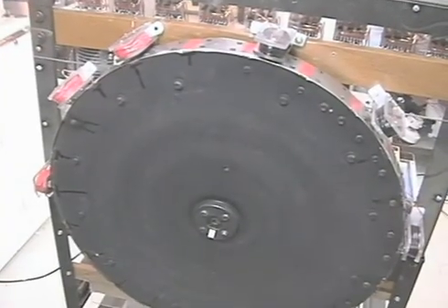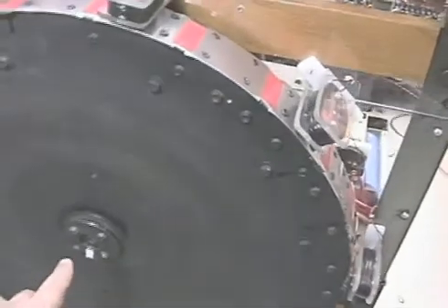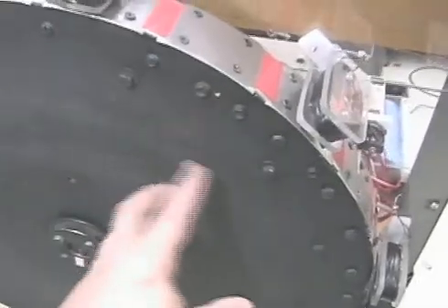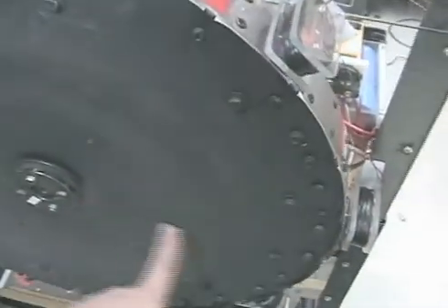The wheel is 25 inches, which gives you a mechanical advantage from the smaller wheel. A smaller wheel wouldn't have this mechanical advantage you get from the wheel being this large. It's basically like using a longer wrench to add torque.